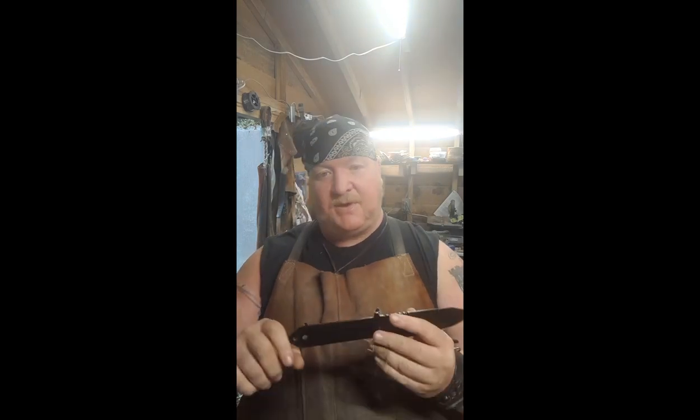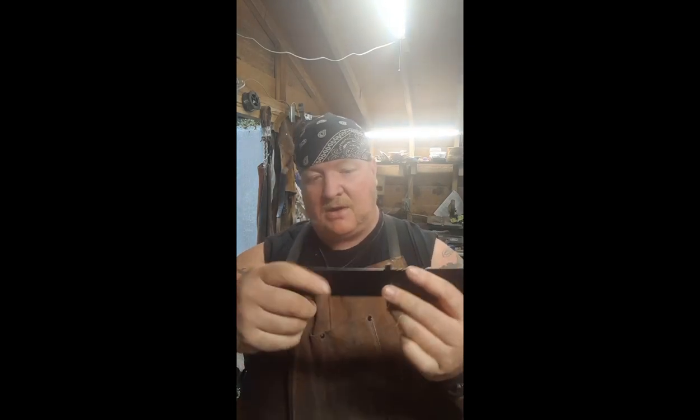So what we're going to do is, like I said, take this big one here and recontour it. We're going to put a finger well here, a little bit of a palm swell, and then make that fit in the hand a lot better than it does now. And then with this one here, we'll take it down to a stick tang and put a proper handle on there. And that's going to be about it. So it's not going to be a lot this week.